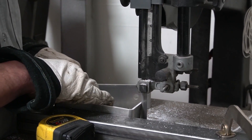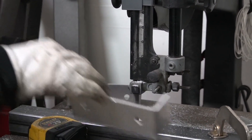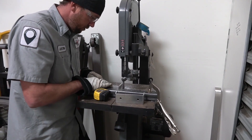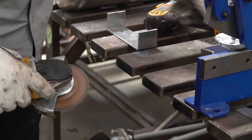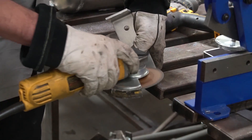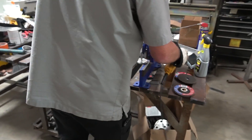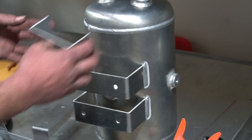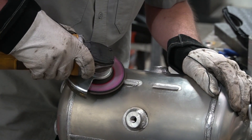The easiest way I've found is to set up a little temporary fence on the bandsaw and just send them all slicing through there. That standardizes the exact amount to take off. You could chase it out with a cutoff wheel, but accuracy goes out the window. I'll take some burrs off — just to scrape them before final prep before welding. We got about an inch and three eighths that came off, which is just what I needed.